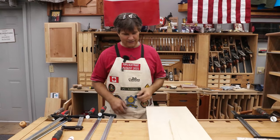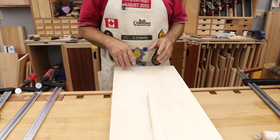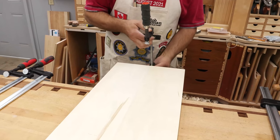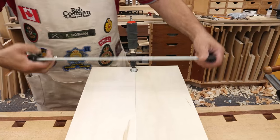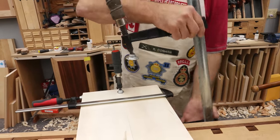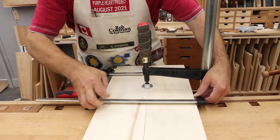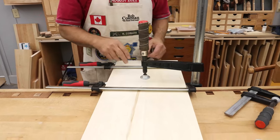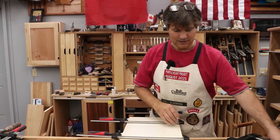Number five: how to find a third hand. When gluing up a long panel, you've got a lot of glue surface to deal with and you've got to work quickly. The third hand is often just a clamp. Make sure the pads are clean, put just enough pressure to hold the two pieces flush, then come in with your clamping clamp and tighten it up. Work your way down the line, using the clamp to hold things flush. This saves you a ton of work and avoids misaligned glued-up panels.